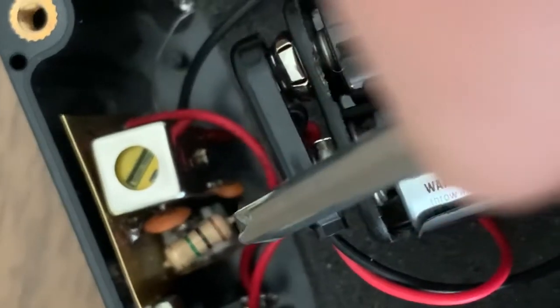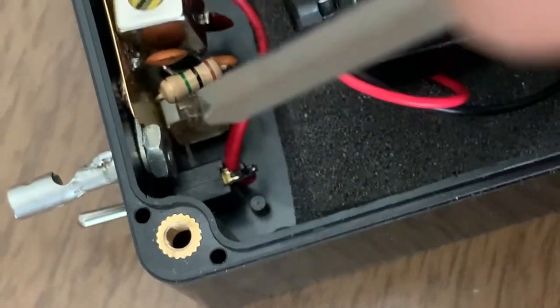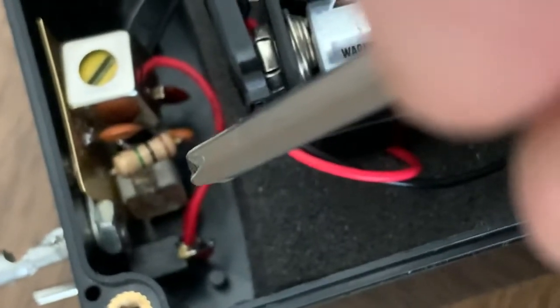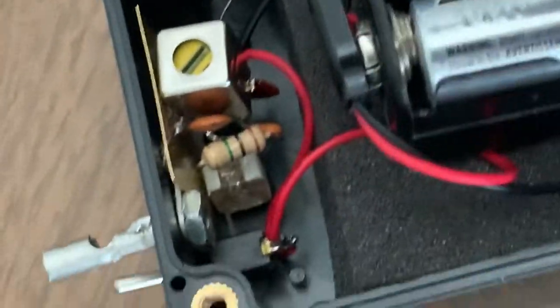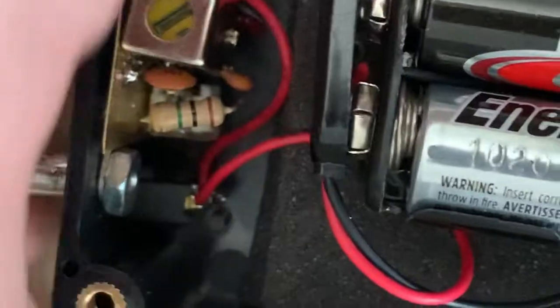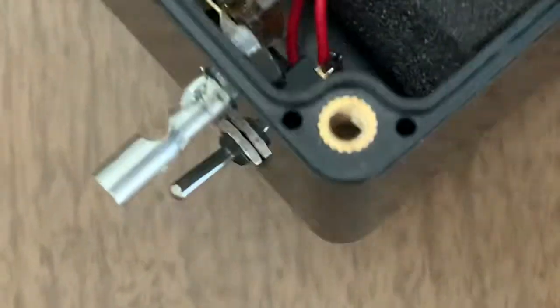This is the tickler that comes from the base to collector to generate the oscillation. In the collector circuit that is part of the oscillator, that is your frequency adjustment — you can adjust frequency with this, but once it's set, I haven't had to. The power supply goes through the switch here, which you can see there.